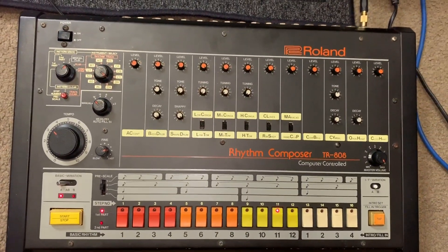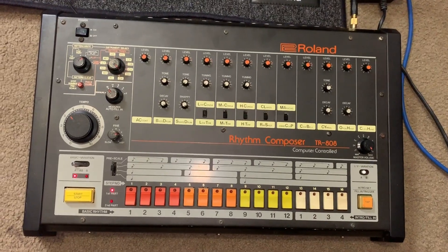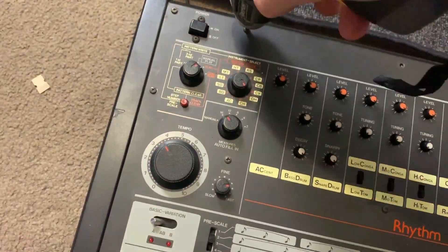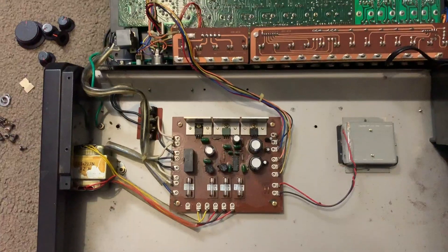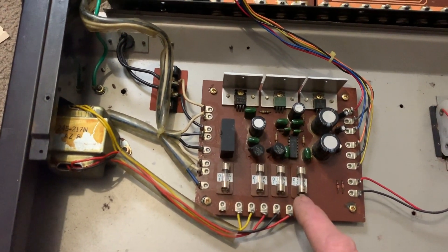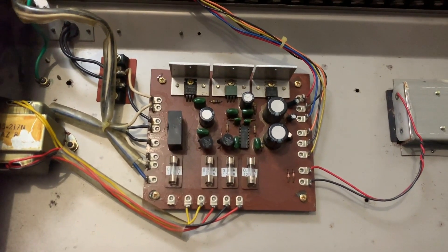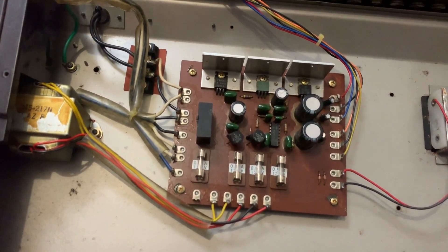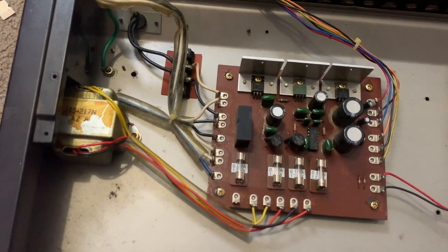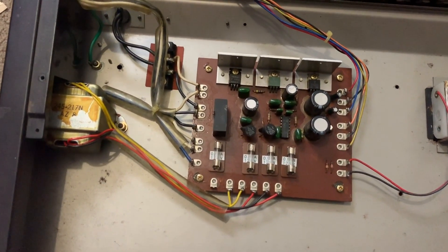Let's open it up and do a quick check to find out which transistor is gone. Hopefully I've got some spares, if not I might have to wait a few days. Inside now, a really good thing to check is to make sure the fuses are the right value — they're all 0.5 amp. The owner said he accidentally plugged it into 240 volts, which just blew the fuses. He was lucky and replaced them with the right ones. If the fuse value is too high, you can damage the circuit on an overload, so it's important they're correct.